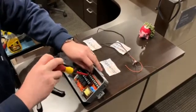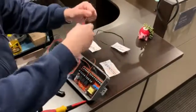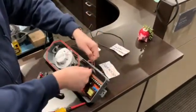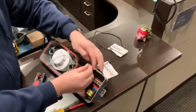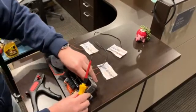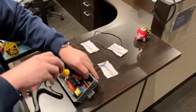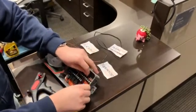This is our terminal 6, and then this is our 24 volts transformer coming from our rooftop, from our furnace. What we want to do is run this in as well — I'm going to land the common on terminal 9 and run the 24 volts to terminal 10.